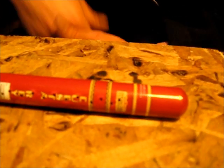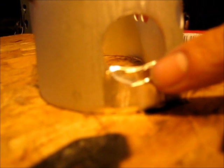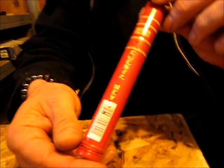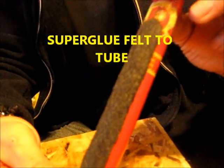That's what I'm going to use on the canteen stove. The only thing I probably could have done differently was make these side holes a little smaller — these are one-inch holes and they're a little big; it's kind of hard to get both sides level. I put some tooling foil tape on the bottom just to get it exactly level and at the height I want. With precision machinery you could probably get it exact. I'd say seven-eighths is a good dimension for the hole. That's the port pattern and right behind it is the priming pad.